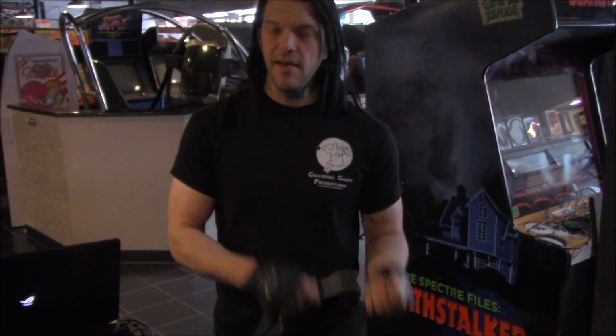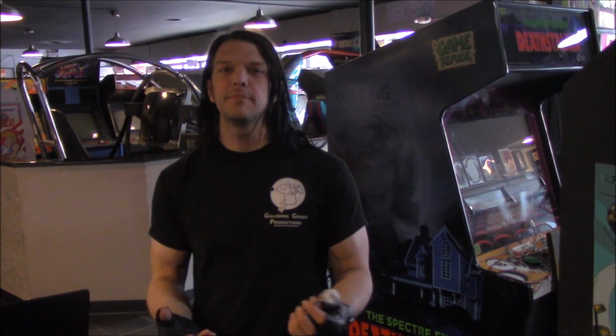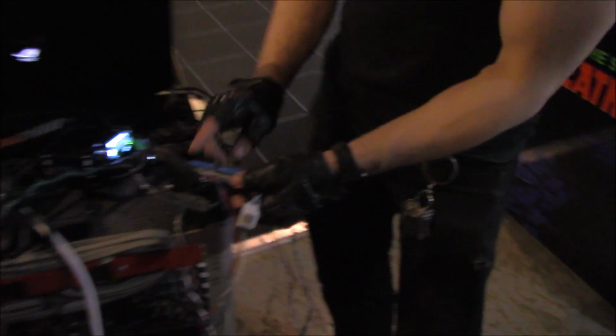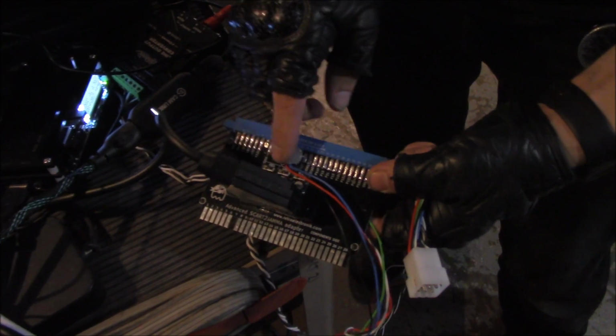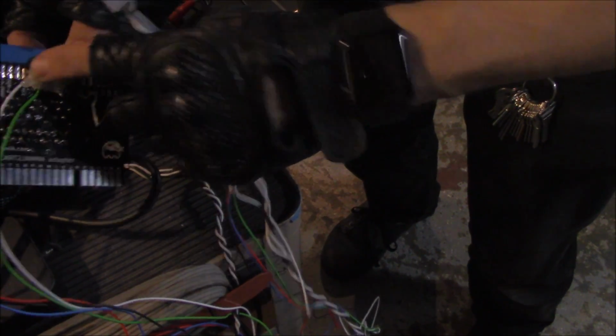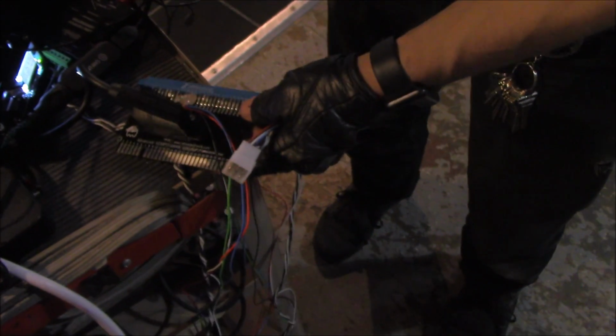We wanted to have it to where any player could walk up to a cabinet and have our guys just plug in through the front of the cabinet, and then you'd be capturing direct feed. So what we did was on the Scart2Jamma, we tapped into the video wires. So you have red, blue, the ground, and then the green and the sync. And we soldered direct to the board and covered it with hot melt glue so it wouldn't pull out.